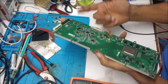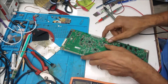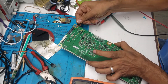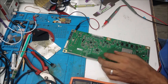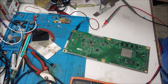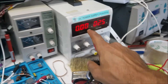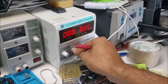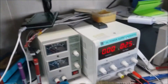The capacitors are testing shorted, but we don't know which specific one is the cause. What I'm going to do is inject some power. I've set up the bench power supply at 2.5 volts with a maximum of about 1.5 amps. We'll start with low voltage and low current, and if we still cannot find the short, we'll put a little more voltage.